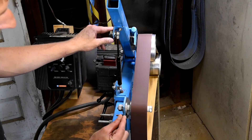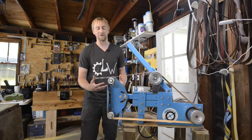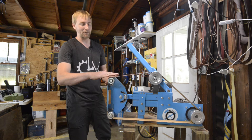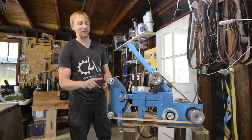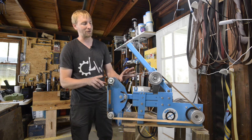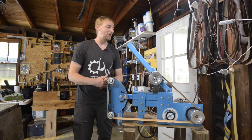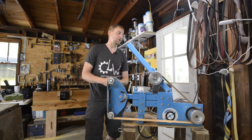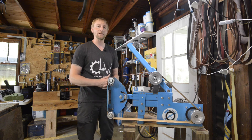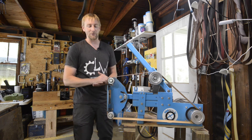What I'm noticing is that I'm traveling all the way on the left side of the tracking wheel and almost as far on the drive wheel, and I'm still not quite over as far as I want to be on the idler wheels. You'll see I still have that bevel, which is usually covered when the belt is in the right position — this is about 3/16ths of an inch. To be honest, as far as my need is concerned, when I'm sharpening, I'm sharpening up here on the slack belt portion, so this doesn't bother me. If you'd like to let me know in the comments what needs to be adjusted to figure that out, I would certainly appreciate it.